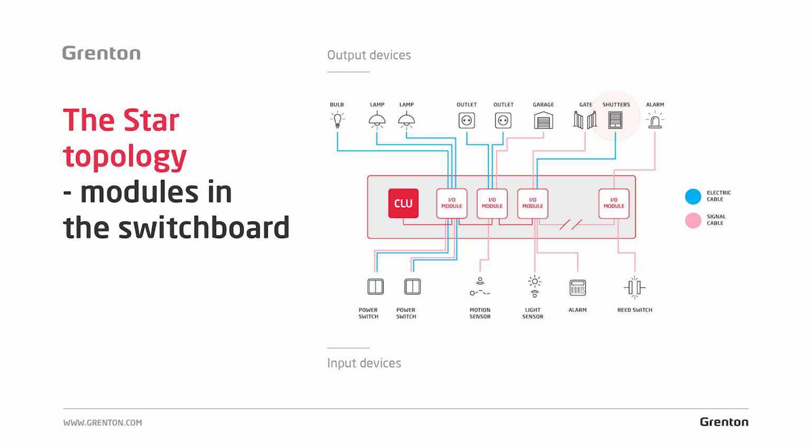There is a certain risk here that if the system wanted to open the window and somebody approaches, then with the switch they would be able to apply voltage in the opposite direction, which may result in burning the engine. So here again, in the case of blinds, the blind is connected with a YDY 4x1.5 cable, for example, directly to the switchboard, and the switch is connected via a cable directly to the switchboard. They are not connected directly to the engine.